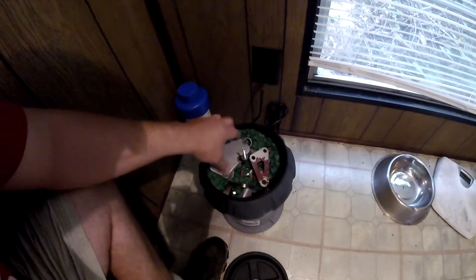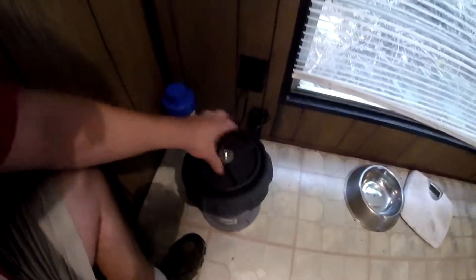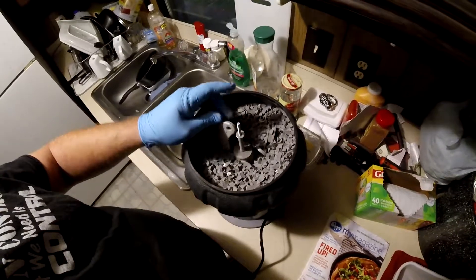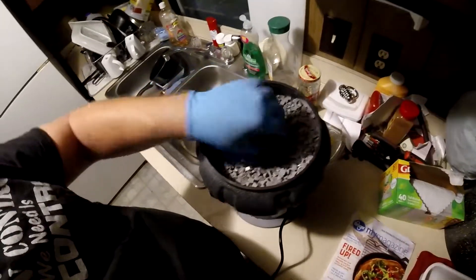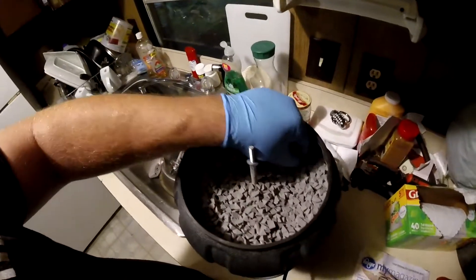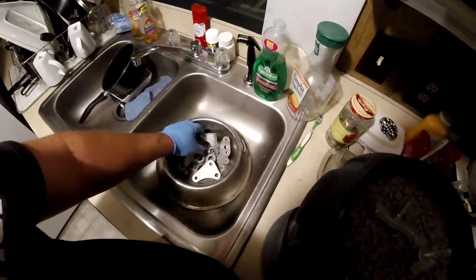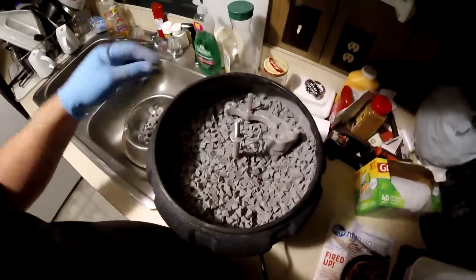Alright, we'll go ahead and let this thing run for a few hours. A few hours from now we should have some nice clean parts. Okay, so these parts have been in there for four and a half hours, and this is what the stuff is coming out looking like — looking pretty good. By the time I soak a couple of these parts in acetone and get all this powder off, they're going to look pretty good. I'm rinsing it off in water, and then it'll go in an acetone bath and soak until I'm ready to take it out, dry it, and paint it. For fifty dollars, this little tumbler did a good job.